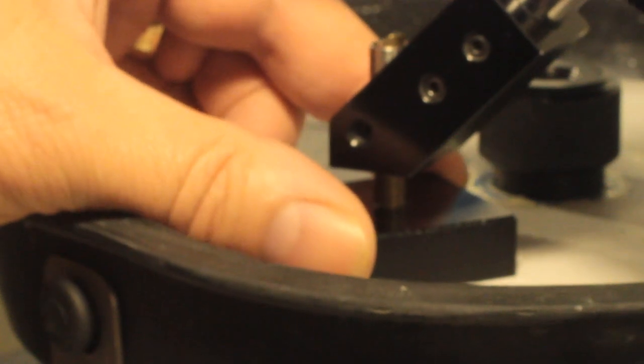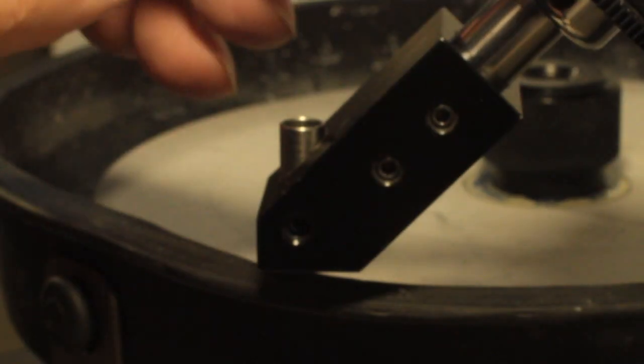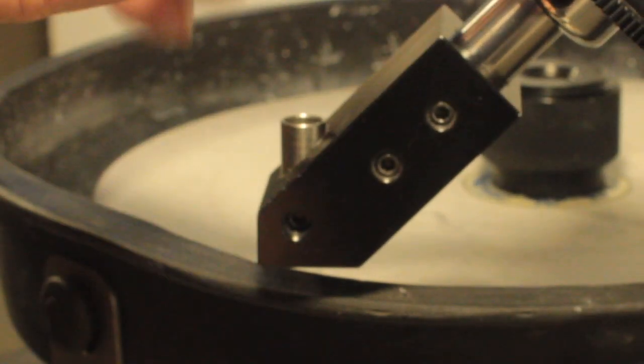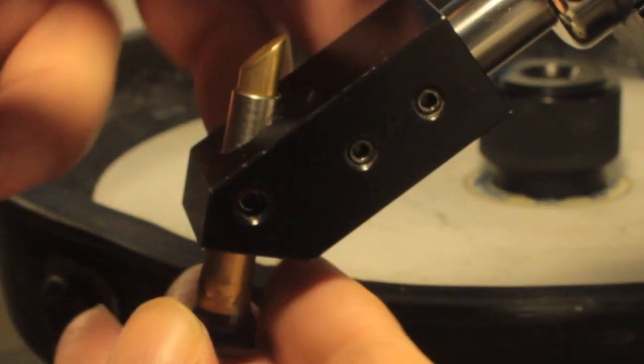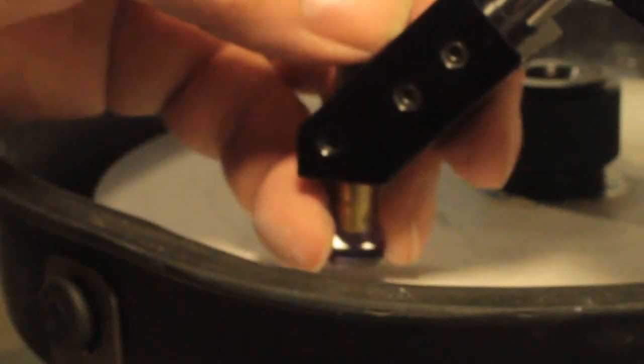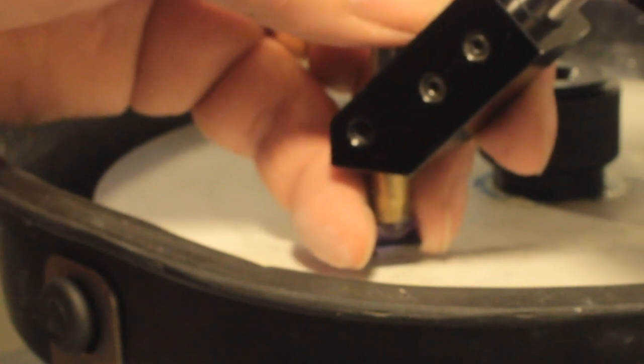Okay, so you tighten up the 2 set screws in your 45 degree tabling adapter, you remove your table aligner, and you put in whatever stone to cut the table on, and your stone is there, then set up to cut the table. That's how we set it up.